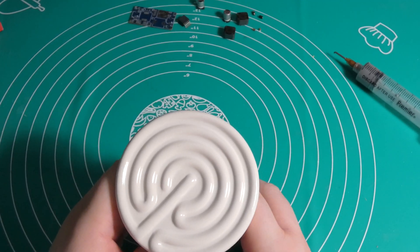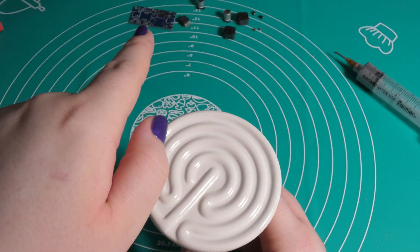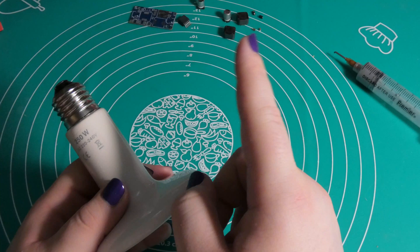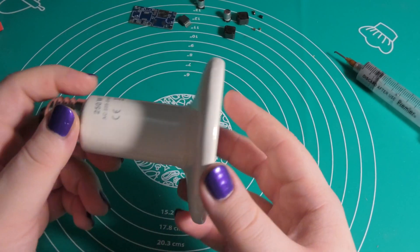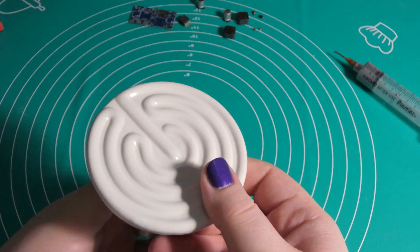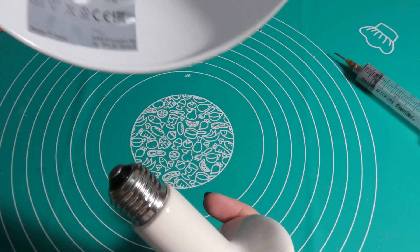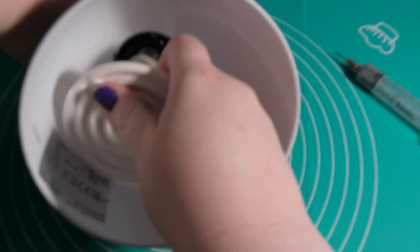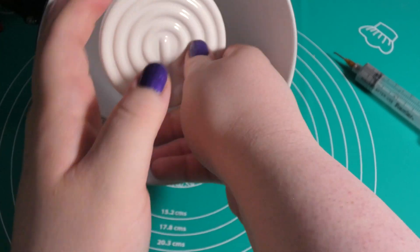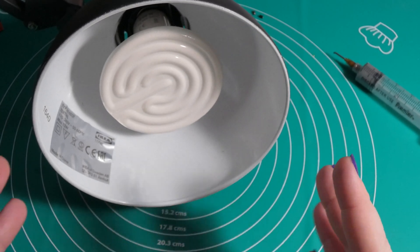We will try this out. These are the remains of one of my broken boost converters that I used as a test subject, and we will reassemble most components I still have to see how well it works. This is one of these ceramic bulbs — 250 watts, 220 to 240 AC. You grab one of these, screw it into a light fixture, and you essentially have an infrared heater that can be used for soldering. It is as simple as that.